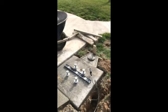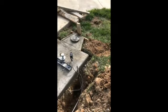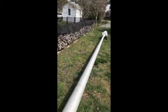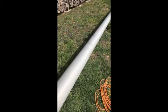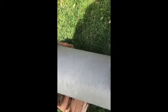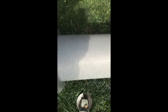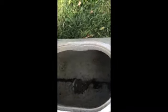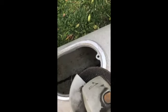My intent here at the end is, you'll see there's a little lip there between the side of the pole and the base of the pole. And my intent there is to cover that with wash gravel to make it look like the rest of my landscape. This is the pole that is prepared. I had to do some angle grinding on this wire access door that you just saw, because I purchased a collar to go down over top of the base plate and the anchor bolts so they couldn't be seen. One of the issues with the light pole is it does have an electrical access panel in it, and it had a lip from the weld. Basically, I took the grinder and ground that down and was able to knock it off enough that I could get it on there.